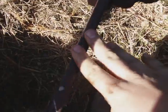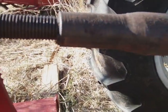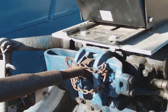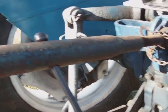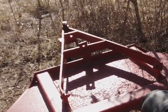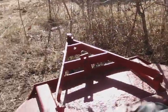You've got these here that are your lift arms and they're hydraulically controlled — you can pick them up or down. We've got this here, which is a top link, and it's just hooked up there. Some tractors have a draft sensing deal, but that's separate. When you pick the arms up it picks the top up too, so if you use it as a two-point hitch it just picks the front up and leaves the guide wheel on the ground. If you have the top link on, it picks the whole thing up off the ground.